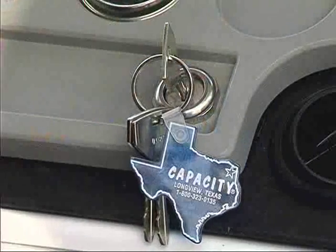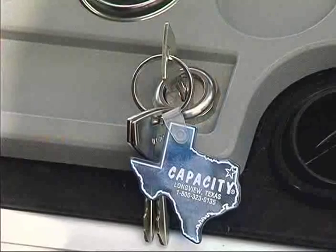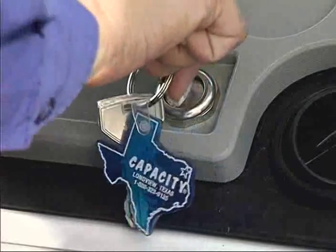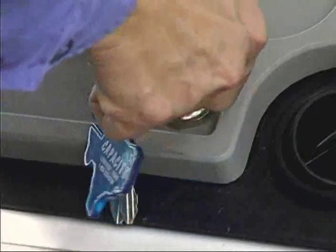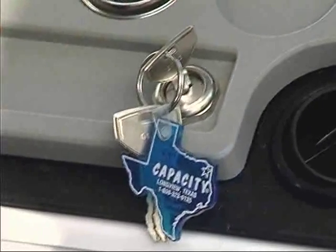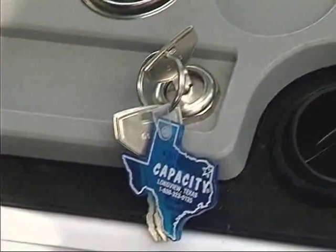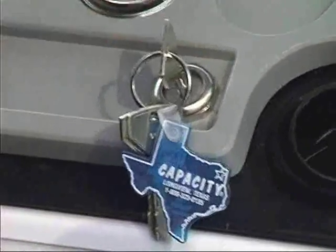The ignition switch is a key-operated three-position switch. In the off position, the electrical system is de-energized. The key can be removed. In the on position, the electrical system is energized. The start position is spring-loaded. This position engages and activates the engine starter motor. When the key is released, the switch will return to the on position. The key must be turned to the off position before trying to restart.